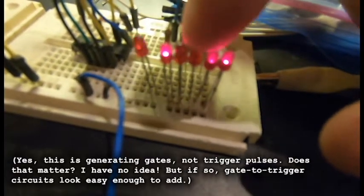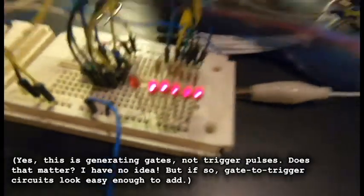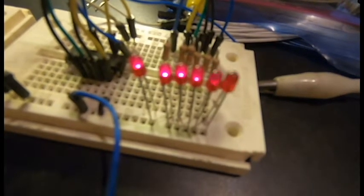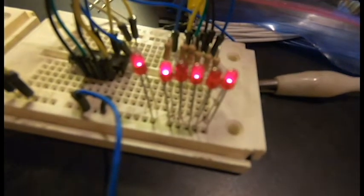So this is on the slow end, which is still a bit fast there, but I'll put out all these pins. So if I want even slower, I can just take one of these down here. That's fine. And if I now move the pot up towards 0 ohms, this gets very, very fast indeed. Faster than I would ever likely use it, of course. That's getting up into audio frequencies there, but that might be fun to play with. So I think I'm going to go with this layout. It'll just be a weird, quirky, home-built clock, and that's just fine.